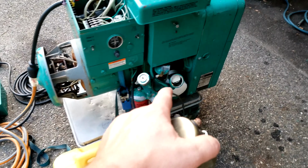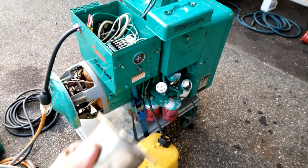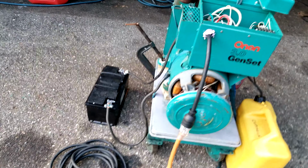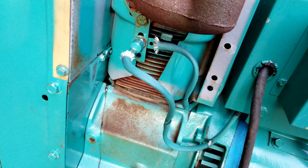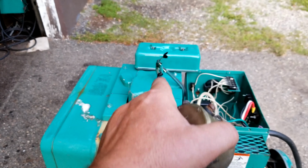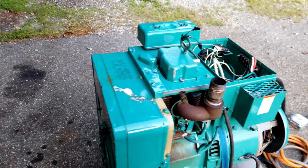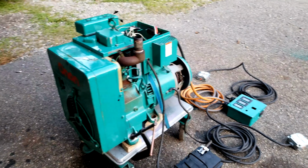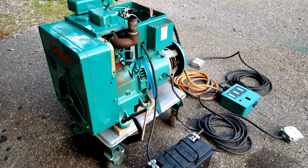And that's providing that we have oil pressure, okay? So it's a few things that regulate this guy. The oil pressure, also there is an overheat sensor on the back. If this thing gets a little bit too hot, it will break continuity, and then we don't get 12 volts up here for this guy. Plunger comes back, machine shuts down. But anyway, we're not concerned about that. So let me get ready, and I'm gonna start this thing up. We'll put a load on it and we'll be back, okay? Hang in there.